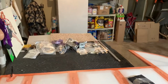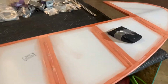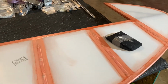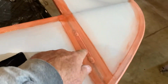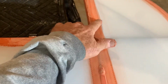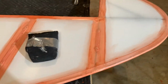As an airplane propeller moves, the prop wash comes back on the left side of the plane and hits the left side of the plane. And I'm assuming that's why they do some things different, like why they put the joint, the overlap, on the right side. And it's kind of strange in that this tape, if you look at it, only wraps and goes to this side, but on the other side, they call for it to stop. I don't do that, but that's what they call for.